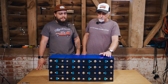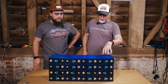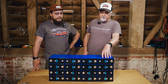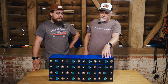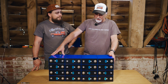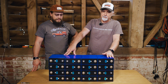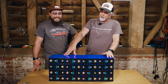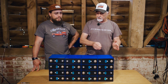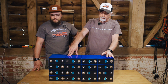This is pretty much a 14 and a half kilowatt hour battery that we're building. Each one of these stacks would be the equivalent of our OPS 300 — a 300 amp-hour battery — and each stack would be the equivalent of roughly 500 amp-hour lead acid batteries. So this is the equivalent of roughly 20 lead acid batteries. It's going to be heavy — about 100 kilograms. We've been looking at various configurations; putting all the cells alongside each other would be just too wide, with only millimeters to spare.